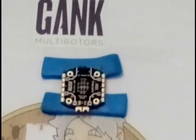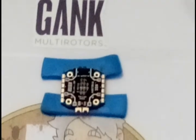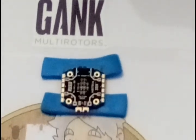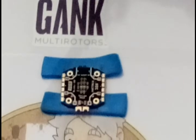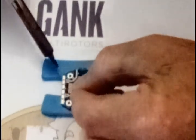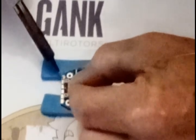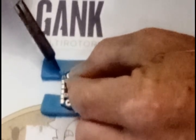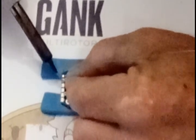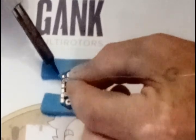All right, we're back. Got the old trusty blue tack out to hold the components. One of the better things since sliced bread. What I find is the easiest thing to do is not apply too much heat at any given time, but to make nice solder joints, use flux. There are different types of fluxes, as I'm sure you're all aware of.